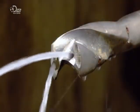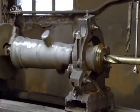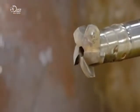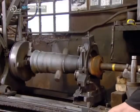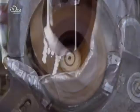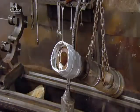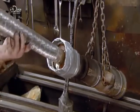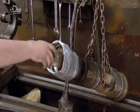At the finishing factory, a lubricating mix of water and oil flows from a drill bit as it bores into the centre of the solid cannon casting. The operator switches bits twice for a gradual widening of the cavity, taking it to a precise dimension. Here's a peep down the cannon's newly bored muzzle. With the nose of the muzzle now protected by plastic, he pours an epoxy adhesive into the barrel. He then inserts a steel liner. The liner is a modification to the original design, a safeguard that will help the cannon better withstand the pressure of ignition.